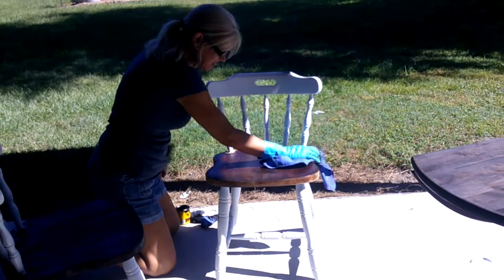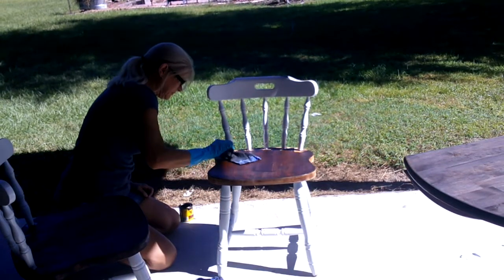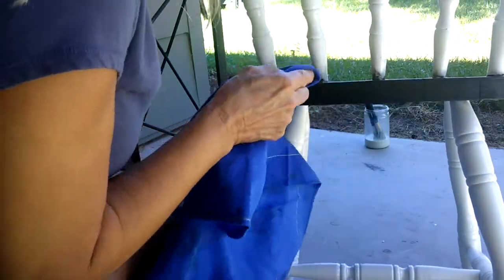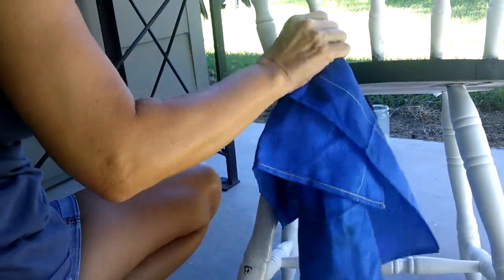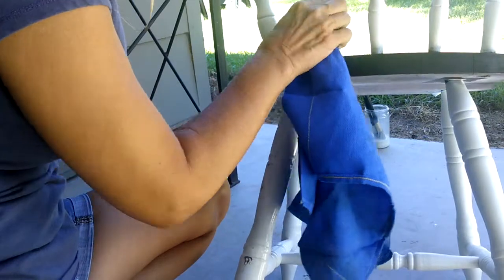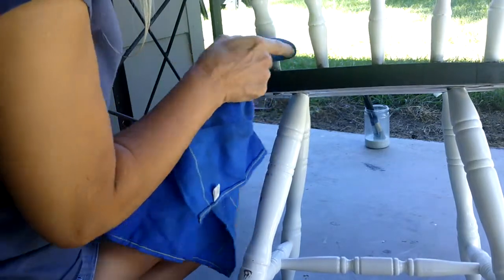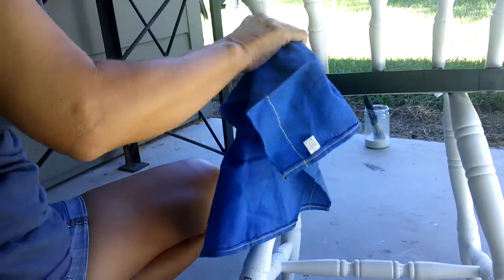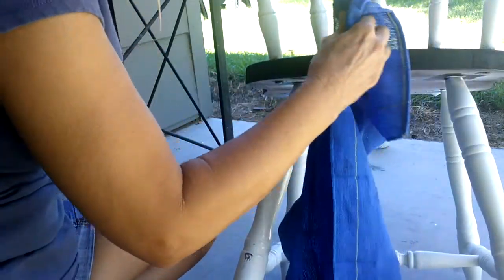Here's a little tidbit that my grandfather taught me when painting. I got stain on my freshly painted spindles, so after soaking a rag in some turpentine, I just wiped the stain off before it dried. Using this method it will clean up nicely — it also works on other paint as well.